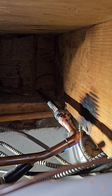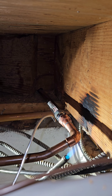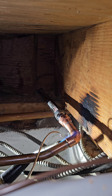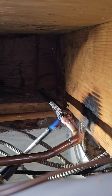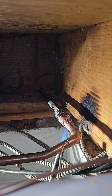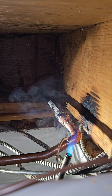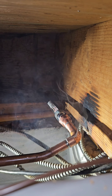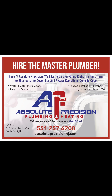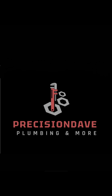Make sure everything is level before soldering - you don't want to solder everything up and then go outside and find it's all crooked. Make sure the finished product is going to be straight. Once it's all straight I pull out the torch. Pay attention: if you're not capable of not burning the wood, put something there. Take your time soldering - don't rush it, because if you rush it the solder starts dripping everywhere and you'll burn the joist. Just take your time. You can see here - nice and sweet - and the finished product comes out real nice and clean. Customer's happy, everyone's happy. If you live in North Jersey and have plumbing work that needs to be done, give us a call. See you in the next one.